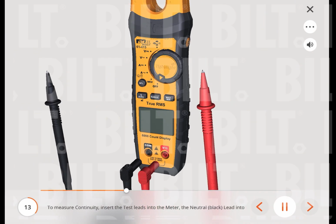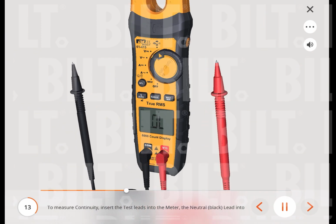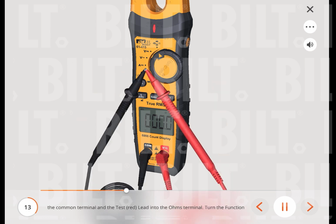To measure continuity, insert the test leads into the meter, the neutral, black, lead into the common terminal and the test, red, lead into the ohms terminal. Turn the function dial to the ohms function. Press the select button until the continuity symbol appears.